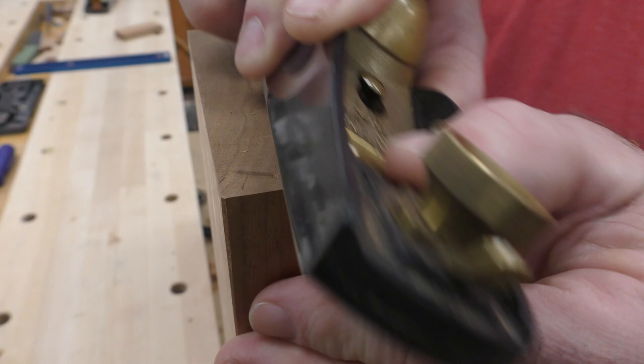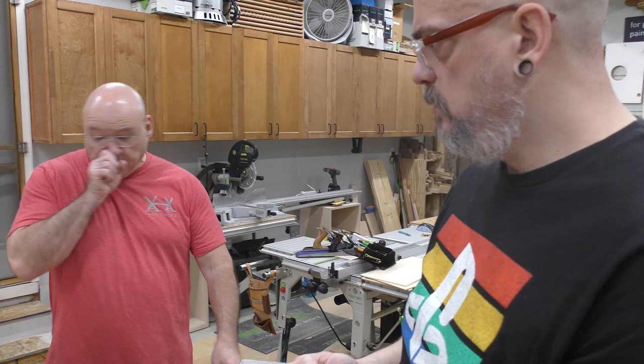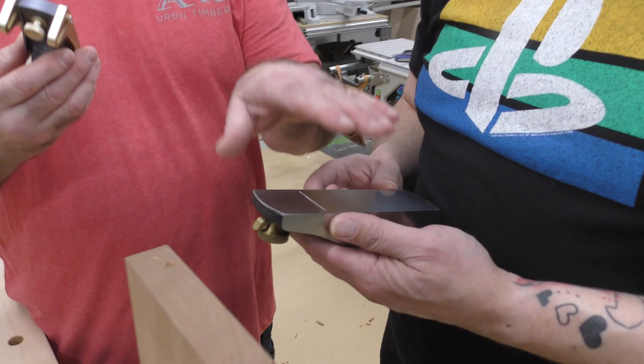This is what I use this one for. Now feel my other block plane — this is an old dovetail iron one, and this one is aluminum. The big difference: yes, this has the adjustable mouth, but the iron one has the weight to carry it through a cut.